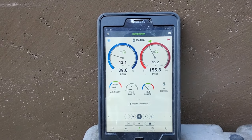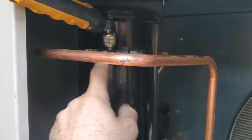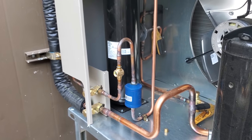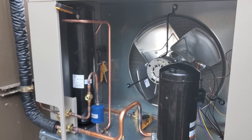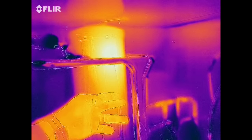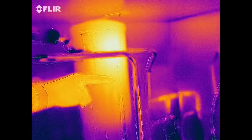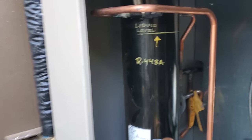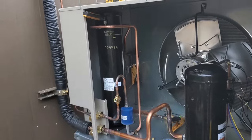We'll just mark all this information down. Then I'm going to check the liquid level on the receiver real quick. We have the king valve front-seated on the receiver and the system pumped down. The refrigerant flow stopped coming out right here and it just backed up in the receiver and the condenser. At this point we're going to go ahead and take a heat-producing device and heat up the receiver and mark the liquid level, so that way the next guy knows where the liquid level is if he ever runs low on refrigerant. With the 20 pounds of refrigerant in there, you can clearly feel — it's cool right here, cool right here, hot, turning right there. So right here is our liquid level. We're going to go ahead and mark that for the next guy.